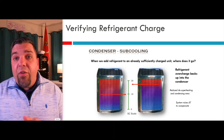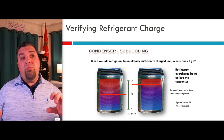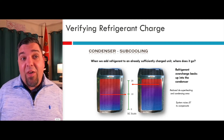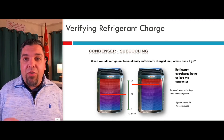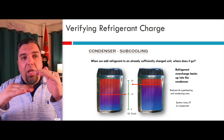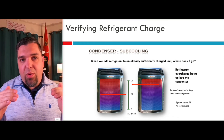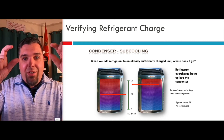When you add refrigerant to an already sufficiently charged unit, think about where does the refrigerant go? The system's already charged, but somebody says those pressures look a little low and puts another pound or two in. If you have a TX valve particularly, it's stacking up in the condenser. The valve will probably protect the compressor and maintain superheat. It's really easy to start slugging that compressor if you have a fixed orifice though. The refrigerant that's overcharged starts to back up in the condenser, reducing the de-superheating area and the condensing area because it's all stacked up with liquid. Your head pressure goes way up because you have to have a bigger temperature difference across this little section of coil to reject the heat and get it below saturation. If there's already all this stacked-up liquid, you've got to do it in a tiny area — no wonder your head pressure's through the roof.